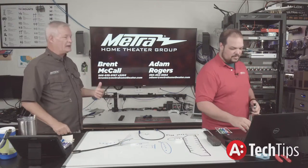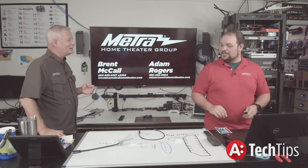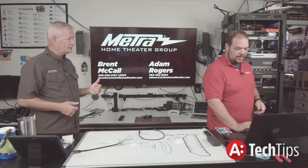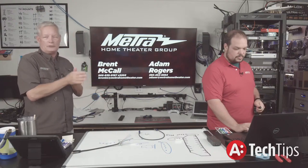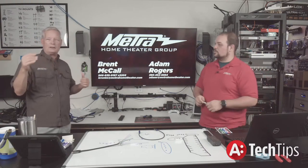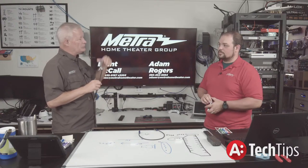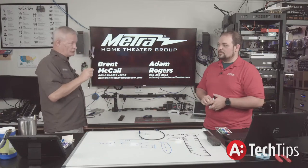DirecTV has actually made it worse — intentionally, we think, though that's hearsay — with a firmware update that is actually requiring more current, not more voltage, but more current on the return path on the TMDS feeds. Voltage and current will continually come back through this discussion, because everything that happens on the HDMI bus — everything in this cable — centers around voltage and current, whether it's the quantity or the speed of transition from high to low.